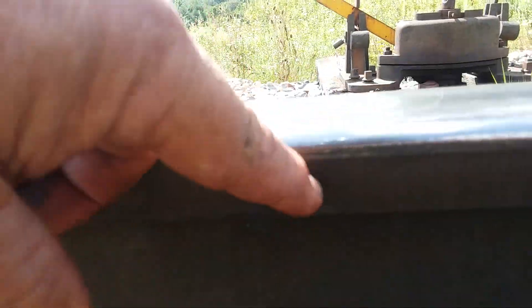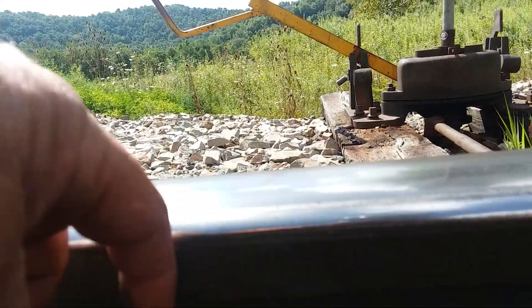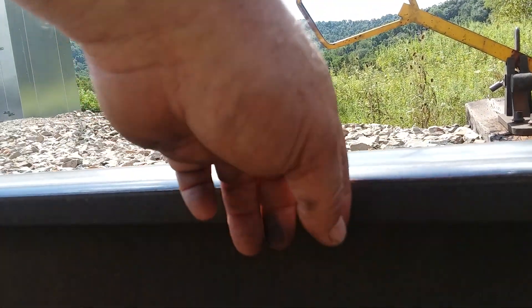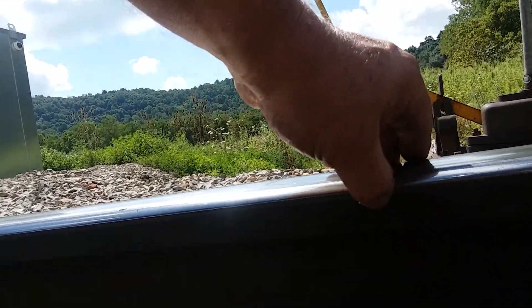I hope you can see this. This rail here is grooved down. This part is straight, and this is grooved in. So this switch point actually fits inside here. On a lot of switches the switch point will be on the outside. So this is what all high speed switches are — they use these Samson switches because it indents in there.